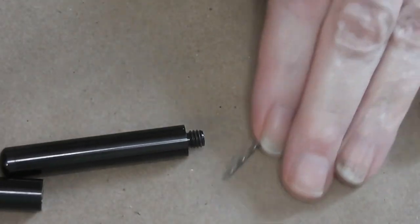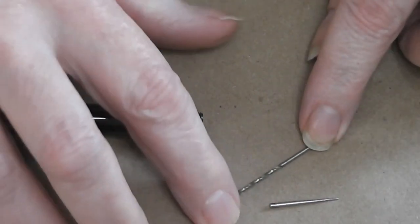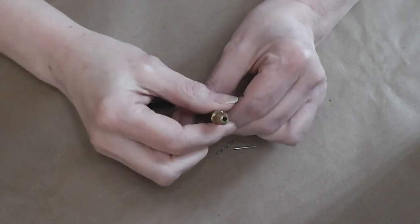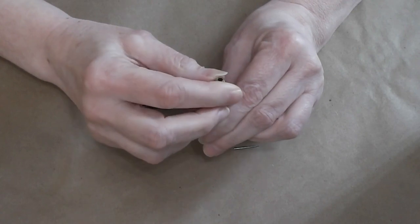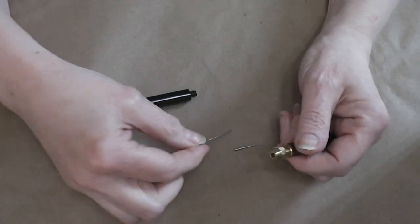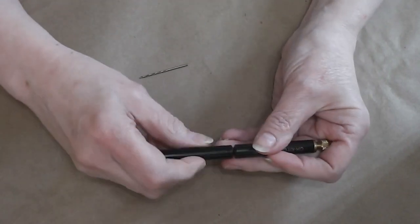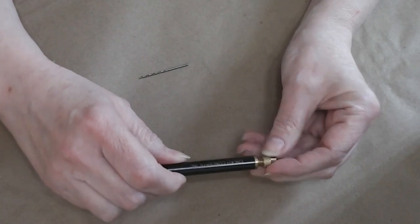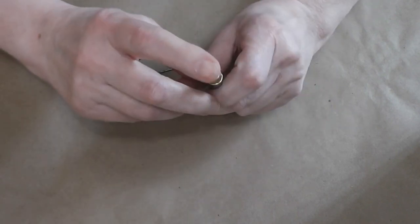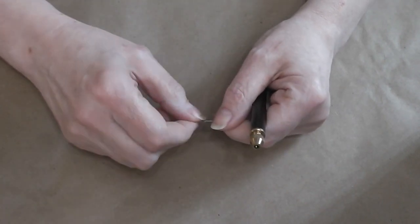They are a very sharp hole poker and a drill. We have a chuck on the end just like you would have on a drill, and these go in — you put them in, screw it tight, and you can use them. We're going to use this a lot. Another advantage is that if you have a really tight space you can break the handle down to a shorter length. I'm going to attach the tool and turn the camera around so we can start putting in the tape wire.